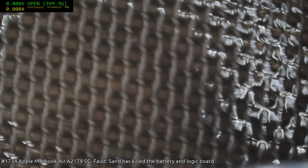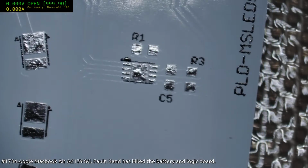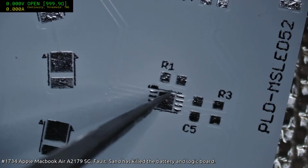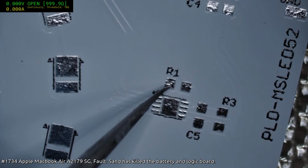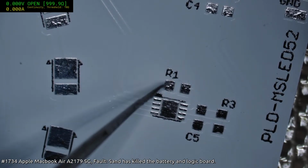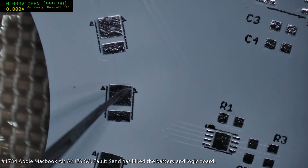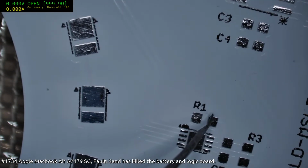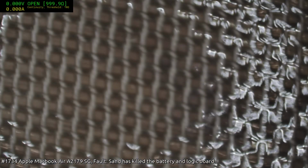Yeah, The Apprentice. Yeah. What else was I going to say? There's a couple of tweaks I could make, like if people want even more brightness out of this, you can change that resistor there, which is at 806 ohm, I think. You can lower that resistor down to around 790, somewhere between 790 and 800 is the peak, and you will get a bit more brightness out of the LEDs. To be fair though, that tiny extra 1 or 2% in terms of human perceptibility just isn't really worth it. All you're doing is creating a hell of a lot more heat for no real gain.